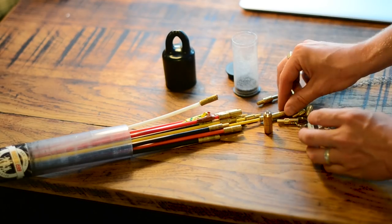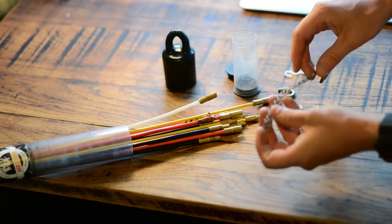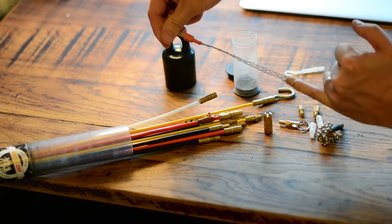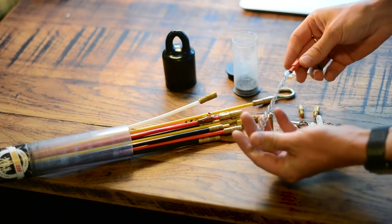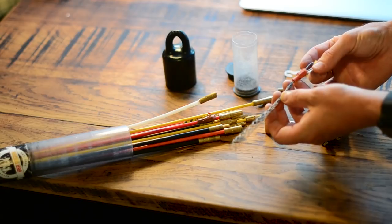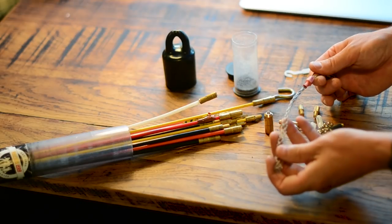And the most important accessory - let's not forget this first - you've got this cable pulling sleeve which I've shown you in the video already. Basically you put the cable in like that, and the harder you pull the stronger it actually grips onto the cable. To pull it off you just pull the end - dead easy. It comes with two of these: the small one, which is perfect for lighting cables or small flex cables, and a larger one you can use to pull, for example, two 2.5 twin-and-earth cables in - quite handy for that.